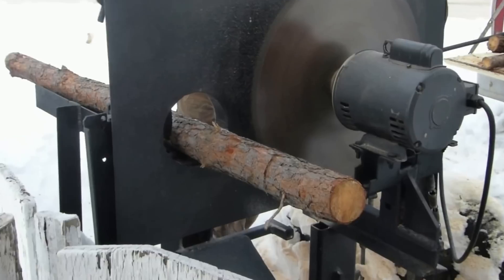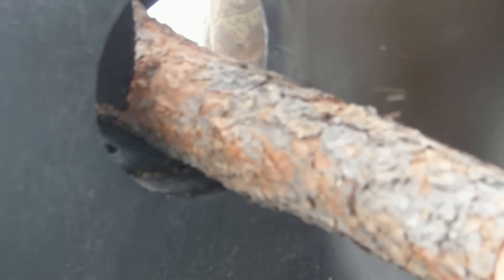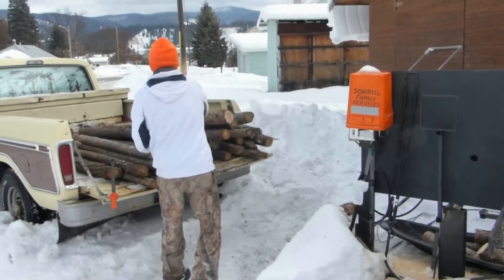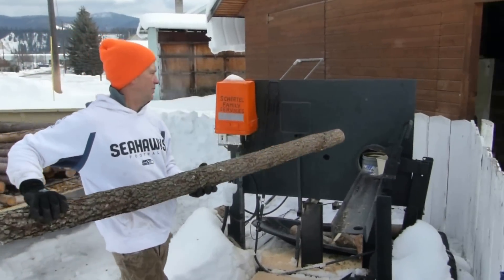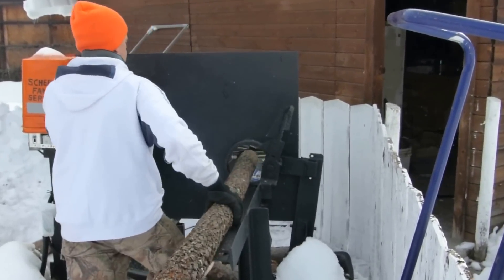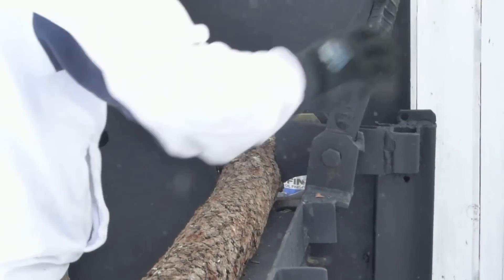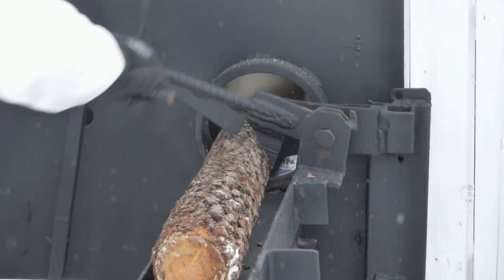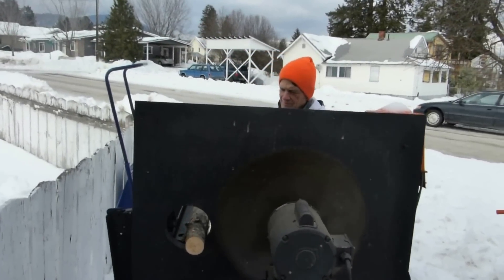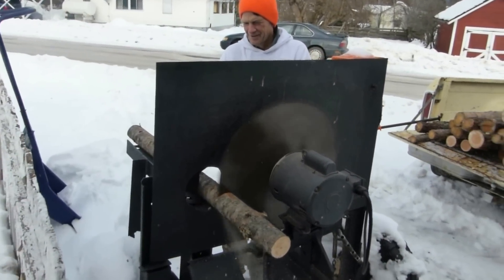That was my concept. I felt that it would be 100% safe this way, quiet, and maintenance-free. These are some things I thought of when I designed this. I built this partition wall here to protect the operator — to address all the old horror stories of buzz saws and accidents. It's giving you some ideas and showing you what I built. It's kind of fun to run; I actually enjoy running these things. I've got the same foot pedal design on the clamp, and also a hand clamp just for extra stability. I don't like the log moving around during sawing, so this thing works really well.